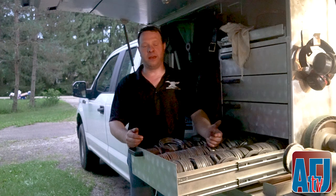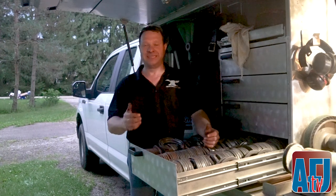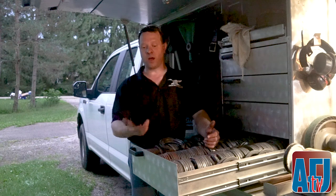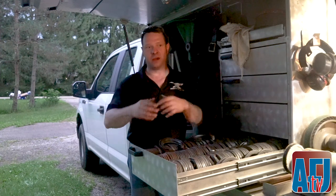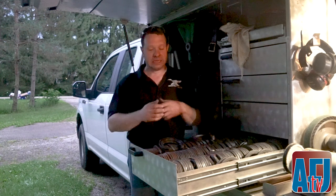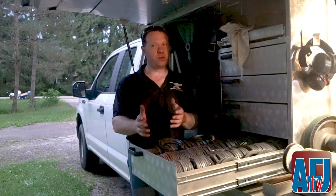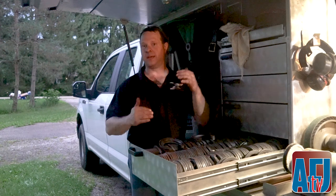You're encouraged in higher exams, the diploma and the AWCF exam, FWCF exam over in England, to take in templates. They have to be removed off the floor before the actual exam starts, but you can walk up to your foot that's untrimmed and set a 12-inch shoe on there, or there are going to be bar shoes once you get into the AWCF and the FWCF exam. Take a 15 and a 16 and 17-inch bar shoe in there, set it down on the foot. Are you in the hunt? Do you know kind of where you're going to be? Maybe it's going to have a lateral extension. Maybe it's going to be a jumped up spiral bar shoe.